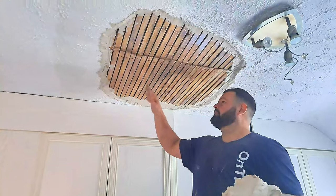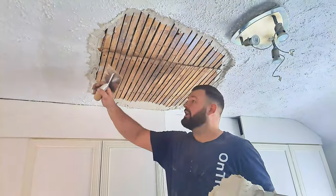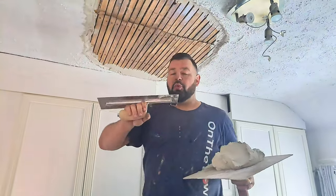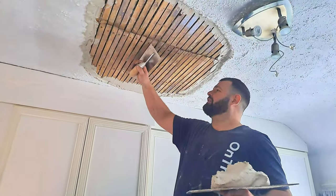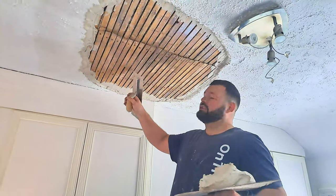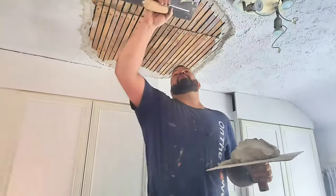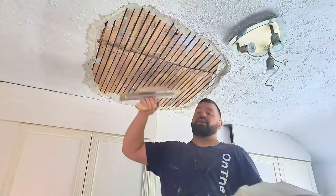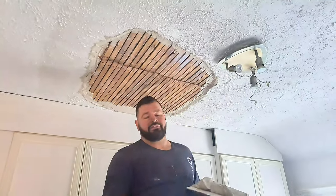Look at the way the laths run. If you spread the material across this way, it'll be a weak first coat because your trowel will go in and out of all these little laths as it's going, and it causes weakness. If you try and spread the gear that way, the material tends to go up and then fall back out of the little gaps between the laths.